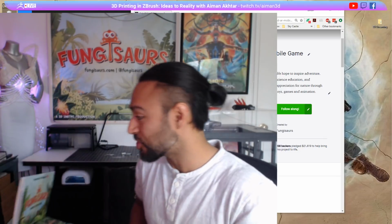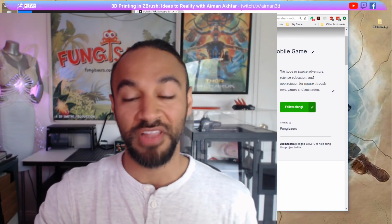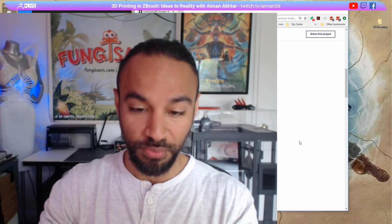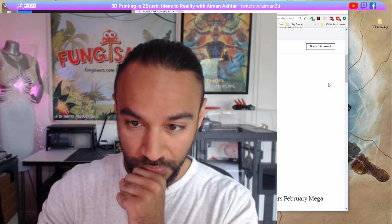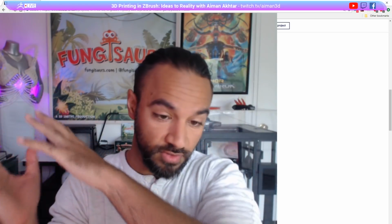Millions of years they lived on this planet, and mushrooms themselves are their own fascinating kingdom in the story of life on our planet. So we launched the Kickstarter. From our latest update, I can show you, we are now in mass production. So the toys, even though they're pretty small, the Chick Wrap you've seen right here, that needs to get sliced and keyed for mass production. And then you can see when it is in mass production, these are 3D prints that then get used for tooling. And tooling is the process of taking a prototype, your first toy, and then making the metal mold that the wax piece will just get melted out from in order to make all of the mass-produced toys in soft PVC plastic.